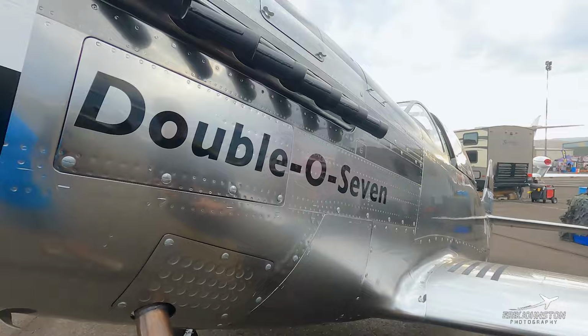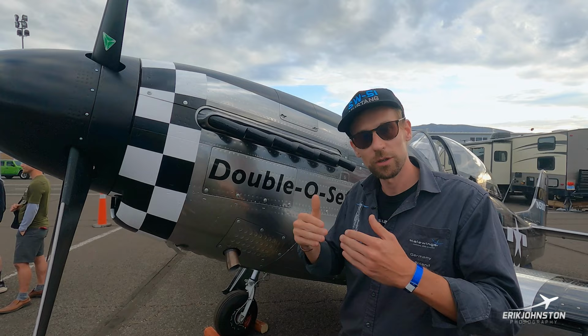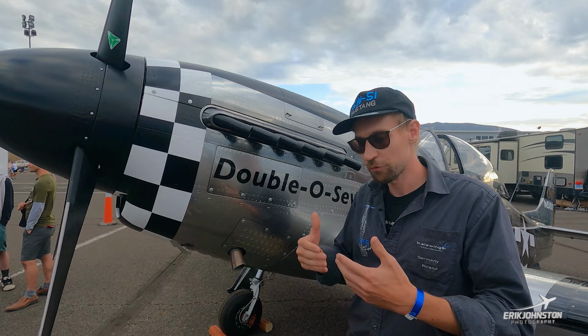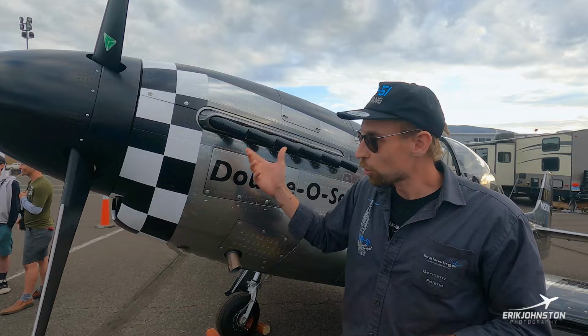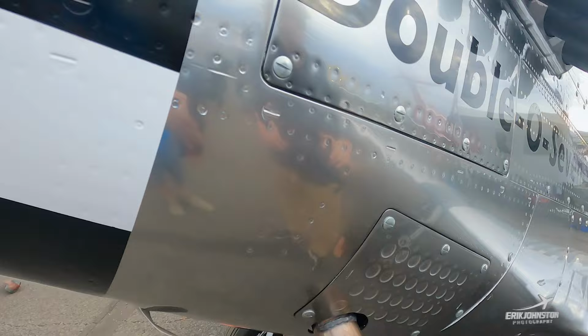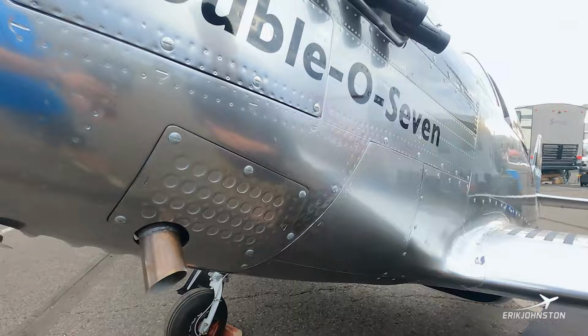How do we do that? We have produced molds which have the counterparts of the rivets, of screws and many other details in the mold, and during the fabrication we apply the fabric into the mold, and during this application of the fabric we print in those surface details. The good thing is we can guarantee the quality. All aircraft are the same. The rivet work, let's say, the fake rivet work, is always the same. Also, we have real screws, which you can find here. Those are useful for maintenance purposes, to remove the cowling, to do daily maintenance checks.